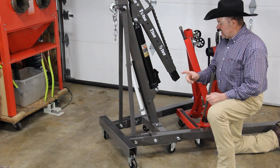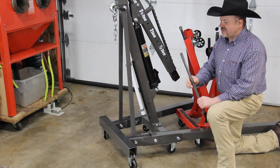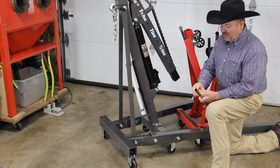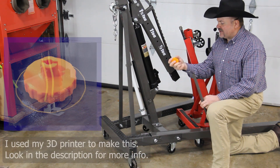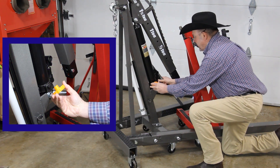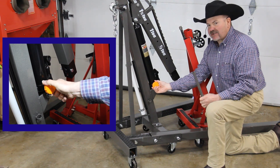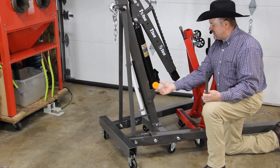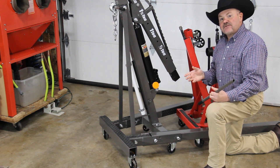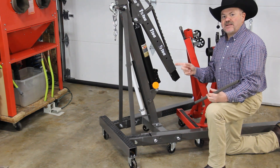The third improvement was to the release valve for the ram. Normally you use the pump handle — it has grooves that fit over the pins and you twist left or right to open and close the valve. So I hopped on Fusion 360 and designed a custom knob with grooves that fits over the post on the release valve. Now I have a nice big grippable handle so I can open and close it with precision, drop just small amounts if needed, and keep my pump handle where it belongs. I've set up an account on Thingiverse — there's a link in the description to download this file and print one for free. I definitely recommend doing this for your shop crane.